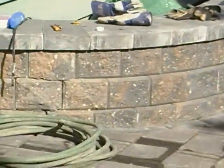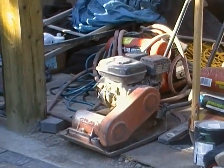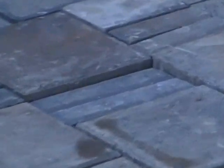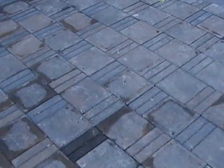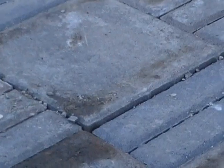We've got all our levels perfect. The next step is to tamp the patio with our plate compactor — right there. We're going to go over the entire thing. Now that the patio is concreted in and the edges are secure, it's okay to tamp, and it should level out any imperfections. You can see there's one right there — those two bricks will actually have to be pulled up and reset because that will not set down properly. But most imperfections, like that one brick that's a little higher, will just tamp right out and get super flat.